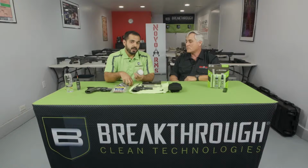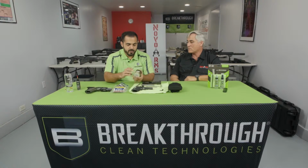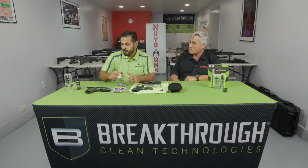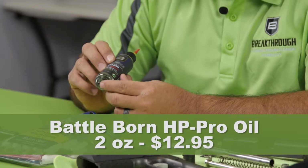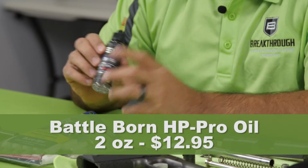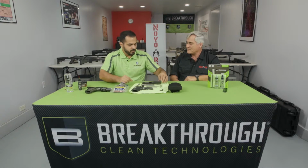The reason why I say that is a lot of our competitors can't make that claim. They're different technologies. All of our lubricants are the same base technologies. Different pour points and flash points, those are the numbers that you see on the outside of the packaging. The grease, for example, is -75 to 510, ASTM certified tested numbers. Our standard Battleborn oil is from -90 to 417, and our new HP Pro, which we'll go into here in a little bit, is from -65 to I believe 507. This one's still pretty new, so I'm trying to remember it. And they can all work together in tandem, so some folks like to use them in different spots.